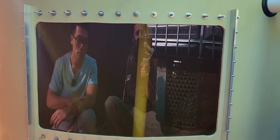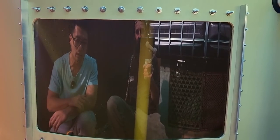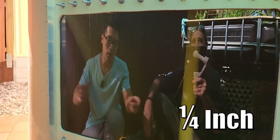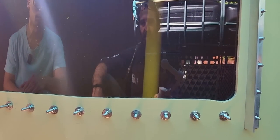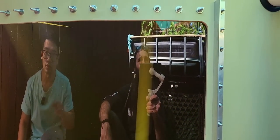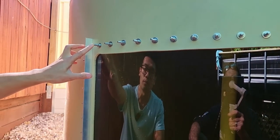What did you use for the window? I went to a local supplier and it's a 6mm polycarbonate sheet. You can get them cut out and drill your own holes, but I got them to drill the holes for us so if we want to replace in the future it's all lasered and measured. The spacing is 50 millimetres centres — two inch.